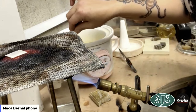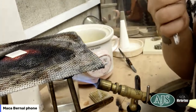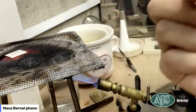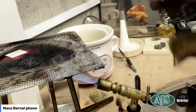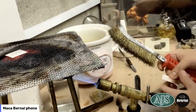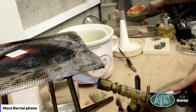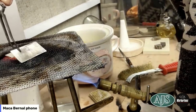While that piece warms up to 650, I can take my larger piece out of the pickle, rinse it in cold water, and according to my notes this would be the ninth time I've quenched it — so one more time and we are ready for reticulation. I didn't scratch it — oh, skipping a step! Any metal brush will do — give it a really good scratch. Remember, we're trying to bring forward copper oxides.